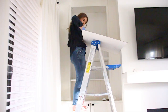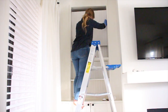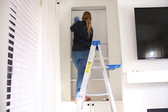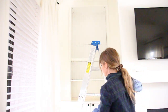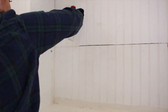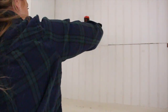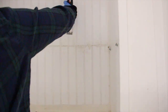Another thing to note is that when you're cutting this beadboard, you'd rather have it be a smidge too big than too small because you want to make sure that there is some nice tight tension when putting up the beadboard. Next I just took some spackle and filled in any of the creases with the beadboard. It doesn't need to be perfect because the shelf is going to be hiding this line, and my shelves are fixed so I didn't worry about the seams at all.